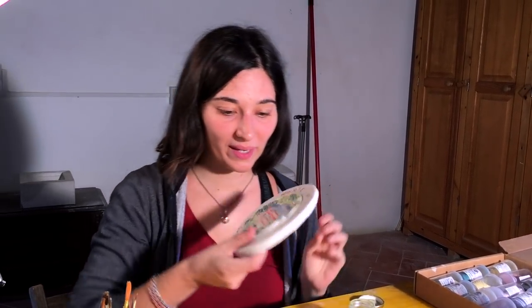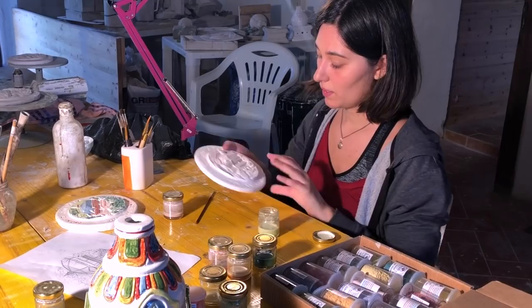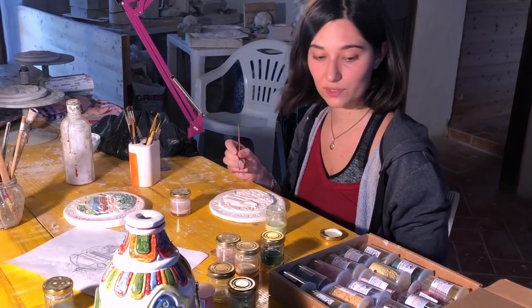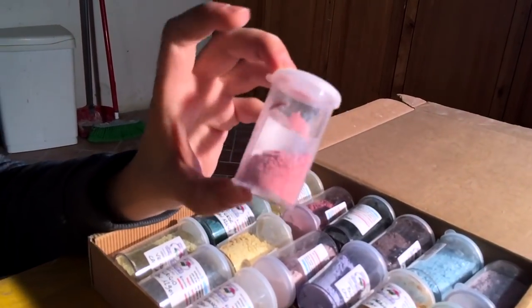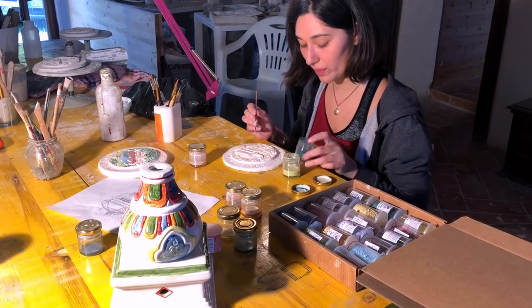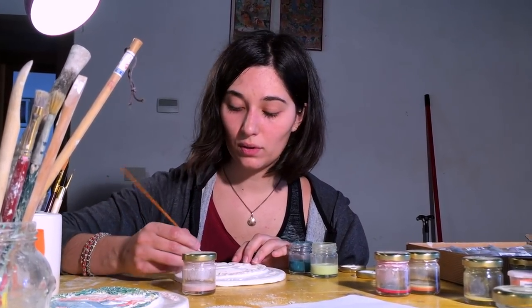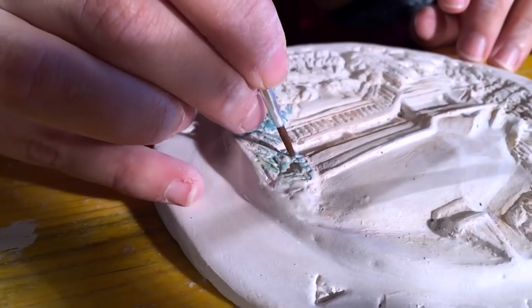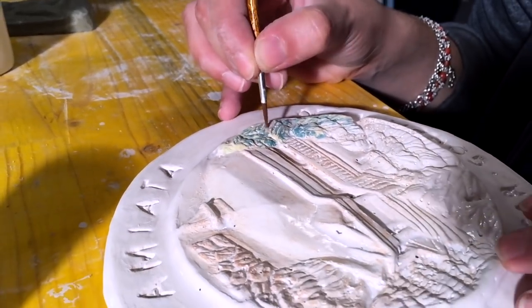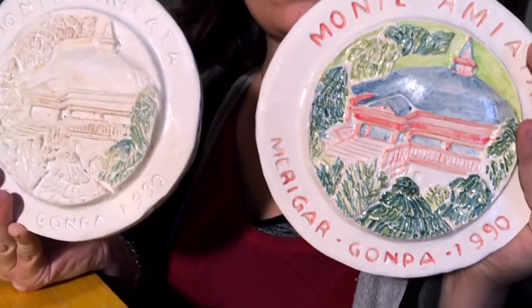This is the final product of colored clay, and this is the gompa of Mariga. This is a mold already cooked one time, so it's hard. Then we have to color it — this is the raw color, and you can see it's like powder. You mix it with some water and it becomes like this. These are special types of pigments because they have to resist the high temperature of the oven, which goes over 1000 degrees. Then you just have to use your creativity — I use different types of colors to create different light and shadow effects. Then we put the smalt and cook it another time.